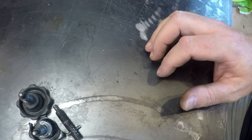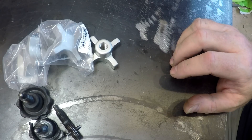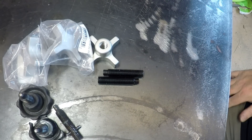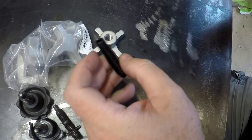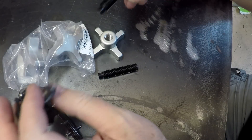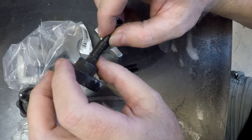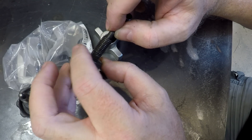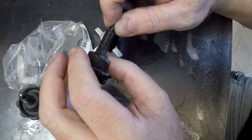McMaster-Carr to the rescue — some knobs and some set screws that are already 10 millimeter by 1.5 pitch. These are already threaded 10 millimeter 1.5 pitch, but these won't work as-is. These little projections go into a groove on the finger that locks the groove and locks the finger. I don't know if it actually has any part in anti-rotation, but it does lock it.